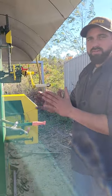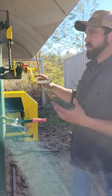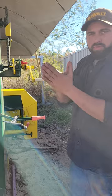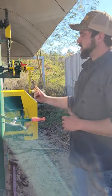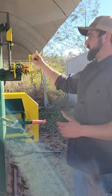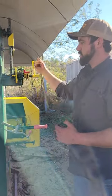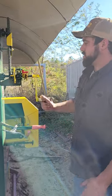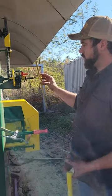Over time, that's running a hardened cup spring washer between two grade-five washers, so that's what's going to wear into those. Over time it's going to lock itself up. All you have to do, with that locked in, is take and spin this handle off so the handle comes off.